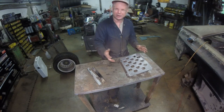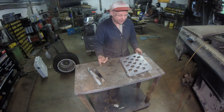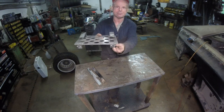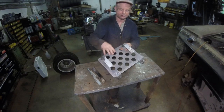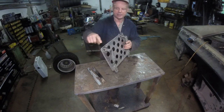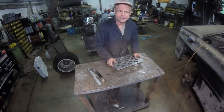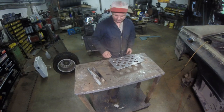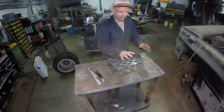I'm sitting there going, huh? Why'd they do that? Well, I know why, because I pulled that other footrest out and I tried to pull this one out and said, how do you get it out? Because what they did was, here are some hinges, and they use pop rivets into the bottom floor pan. And then, right here, they had a piece of metal across there. They use more pop rivets, and it's also affixed with three bolts per side. Looks like probably M4s with an 8mm nut, and a 4mm Allen key on the front. What a pain to get off. Oh my God. So what I did was I just zipped off all the pop rivets and pulled it out. And I just used their old rest and I set it in there correctly.